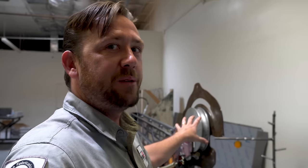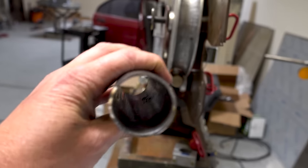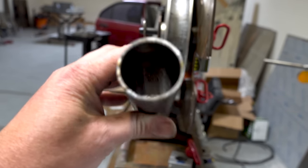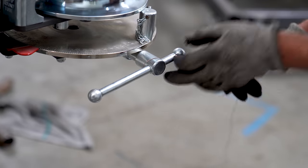Once you get that bender, what you've got to look forward to is learning how to use it. I know a lot about bending tubes and I know this bender extremely well — it's one of my favorites — but I had never mandrel bent before, and that unfortunately has cost me a bit. The mandrel fits so tightly inside the tube that when you push on it, it's pushing air back out against your hand. You have to clean the inside of every tube before you bend it — oil, dirt, chips, whatever's in there.